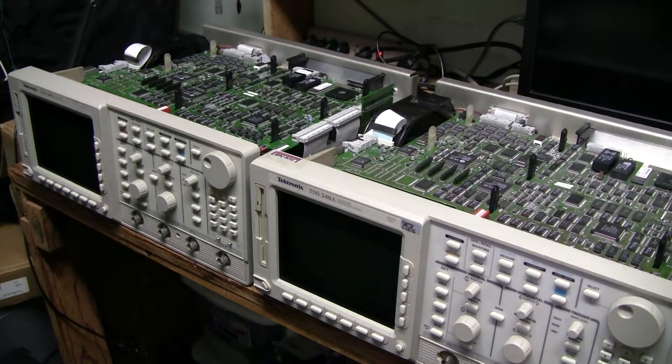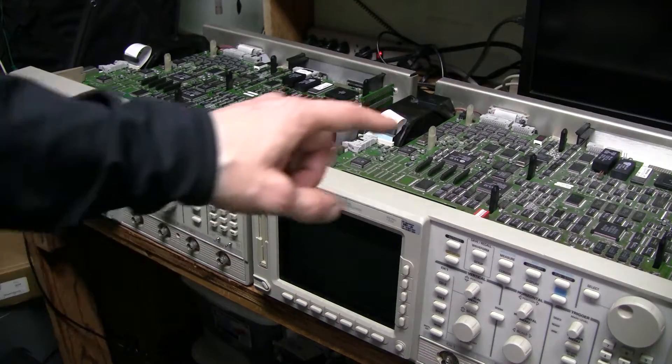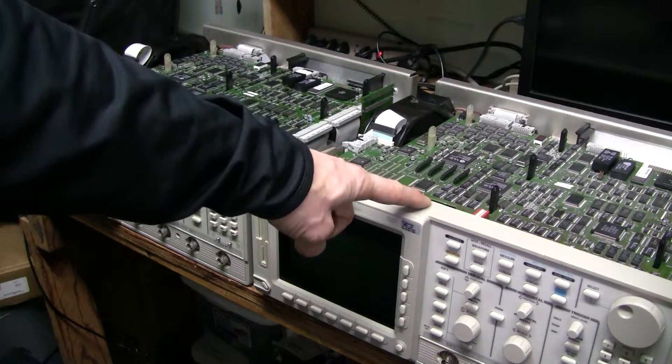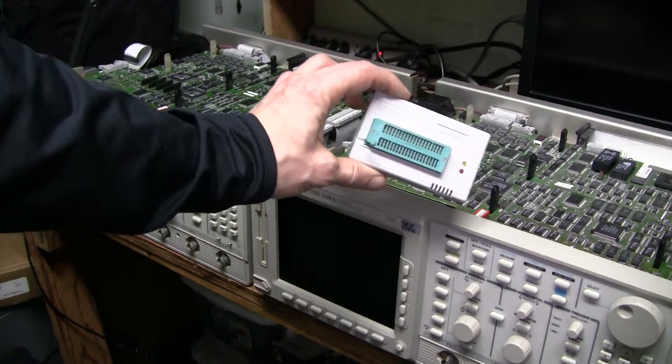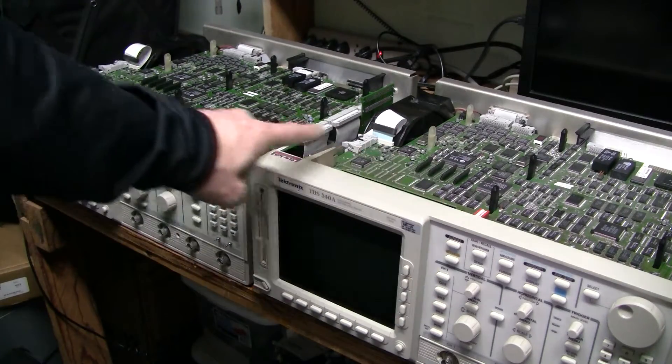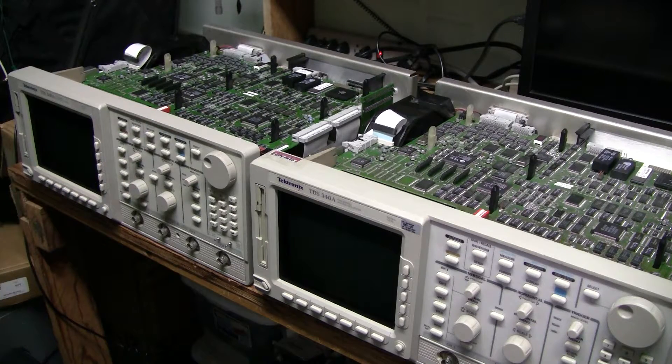Now I think that is wrong. One of the reasons I think so is that I found a backup I made several years ago from this scope, and I didn't have this programmer at that time. I borrowed some other programmer from a friend and completely forgot that it supported the DS1650Y. Somehow I had decided that I treated the chip as a DS1250Y as well. So I found the file and compared it with this one, and they look very different.